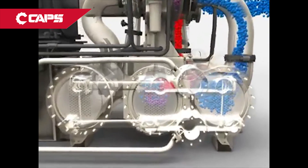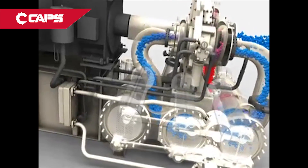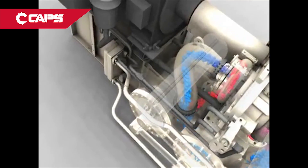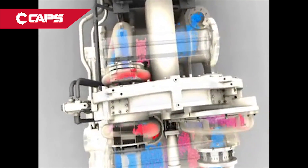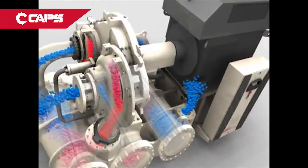The coolers knock moisture out of the air through temperature reduction. Water flows through the extended surface-style tubes, which effectively reduce the air temperature to as low as 5 degrees Celsius, or 8 degrees Fahrenheit, above the inlet water temperature. The generously-sized coolers have an ultra-low pressure drop, further reducing power consumption.